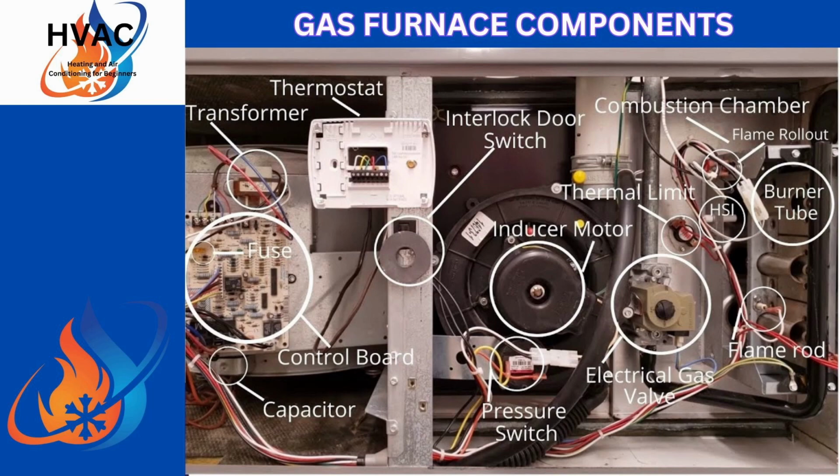It automatically will transfer 24 volts. Actually, it reads 27, like 0.1, 0.2, and that is your low voltage current. That's always called control voltage because it's always controlling something at a low voltage level. Your thermostat, of course, is not going to be connected to your furnace. They just put it on here as a platform.